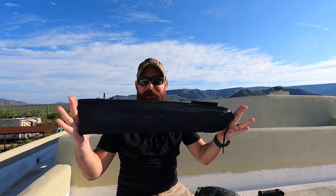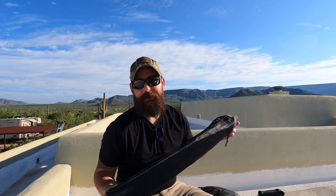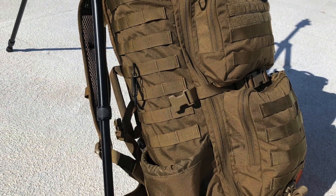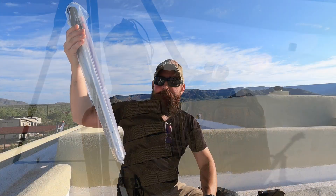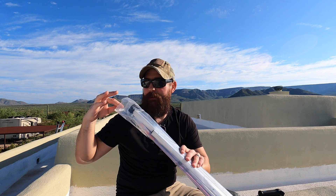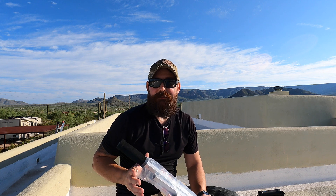In my pack I'm carrying the Arrow 2 antenna — this is the two meter and 440 version. I'm not running the 440 elements but I can. I've opted to pack it in a tent stake bag I've had; it fits nicely in the hydration bladder side pocket of my pack. The packaging material was really nice — they use a heavy mil set of plastic bags — so I'm actually using it for additional protection. My version is a bit longer than the three-element Yagi, being four elements on two meters.